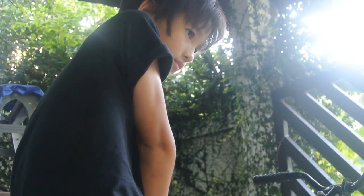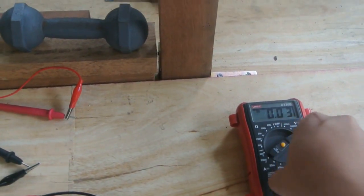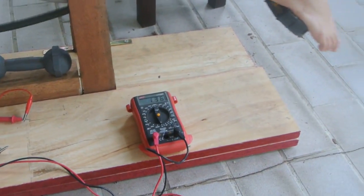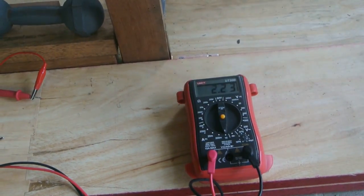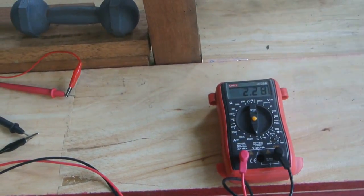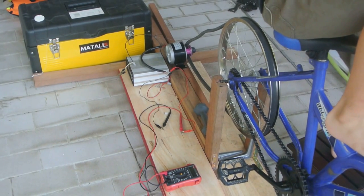Was it hard? Not too hard? You could do that for an hour? Next test is an amp test - let me swap the meter to amps. Same thing, go ahead and pedal like before. We got 2.3 amps - that's hard, huh? That's enough to do a calculation. We'll probably get more if we had a better pulley with a little more tension, but that'll do for now.